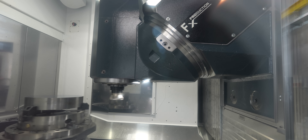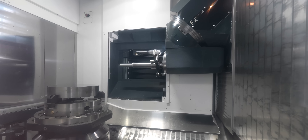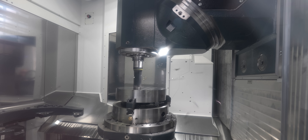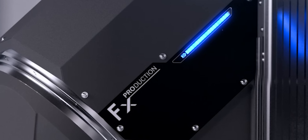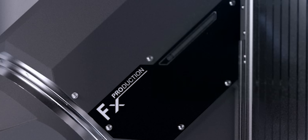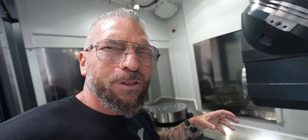See this guy right here? That's a trick. When you're actually in here setting things up and moving through your setup, running a program and looking and looking — instead of looking back at your controls when you're in G1, there are colors associated with it. You'll see that this guy right here — the colors will change to actually show you where you are on the program. Instead of looking there, as you come to the lower numbers with the color change, it gives you that sense like, 'I'm almost there, be careful.' Cool, right?